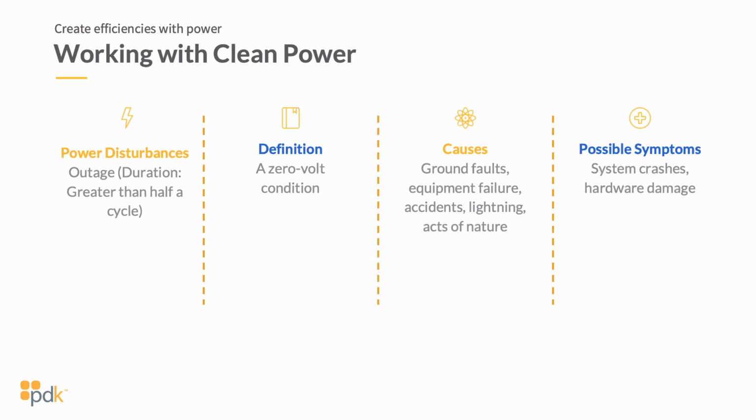So again, the power coming into your home is utilizing transformers as well to help deliver that power efficiently. And so problems can be caused there, as many of us have seen. So obviously a system could crash, you can cause hardware damage. And so that's the benefit of utilizing a UPS and line conditioners. Now obviously a line conditioner isn't going to help you in a power outage situation, okay? So if your main concern is power outages, which should be all of ours when we're looking at access control certainly, but even other critical components within low voltage, you want to make sure that you're incorporating a UPS and determining how well it conditions that voltage. And if it doesn't do line conditioning very well, make sure you add a line conditioner if needed. Most of them, certainly if they're built for this type of use or commercial use, have line conditioners built into them, so you won't have to worry about that. But again, a UPS will help in an outage situation, but a line conditioner will not, because it doesn't have those same capabilities.